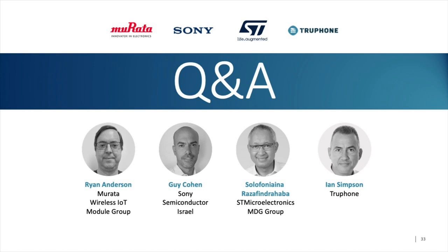In addition to that, we do support as well lightweight machine-to-machine with the X-CUBE-CELLULAR from key partners. Indeed, for cellular, lightweight machine-to-machine is the best protocol to optimize the power consumption to reduce the bandwidth, especially in narrowband IoT. In addition, the lightweight machine-to-machine has built-in services allowing to support natively device management, like device firmware upgrade, remote configuration, and many other features in a standard way.